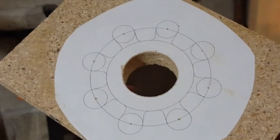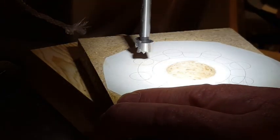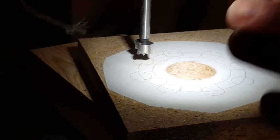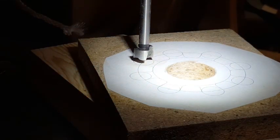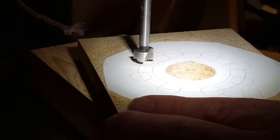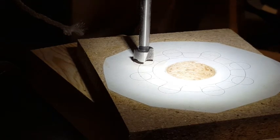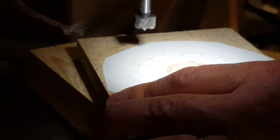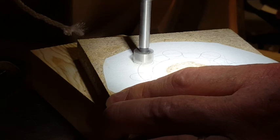Here's what the gear looks like with the hole for the bearing drilled in. Next I started drilling the holes where the dowel sections are going to get glued in. Once again I'm slowly lowering the Forstner bit so that the center of the bit finds the little divot I made with the awl. I'm trying to be as accurate as I can — it's all done by eye. I'm wiggling the particle board side to side to verify that the center of the Forstner bit is indeed in the divot. Once everything is lined up, I turn on the drill press and drill the hole.